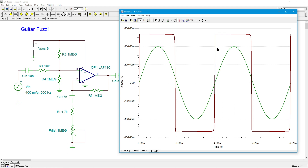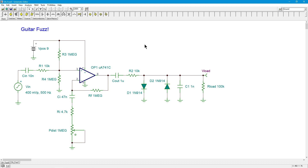When you get these sharp corners, what you're really saying is lots of high frequencies, lots of overtones and harmonics. It's a relatively simple circuit for the most part - operates on a single 9-volt battery. There are a lot of variations on the theme - fuzz boxes have been built with discrete JFET stages and discrete bipolar stages, op-amps, so on and so forth. There are a lot of options, and this is a popular example of the type.